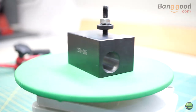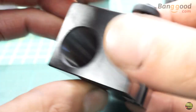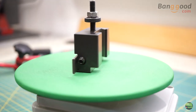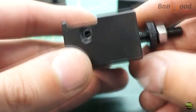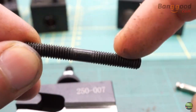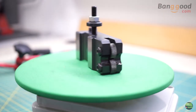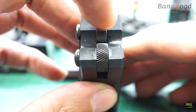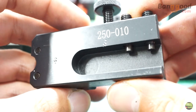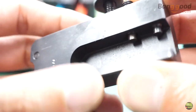The 250-005 holder is another solid piece of steel with a Morse taper, for attaching a drill chuck or any other tool with an MK2 taper. The 250-007 is a cutting or parting holder for a half-inch cutting blade. It's really solid and the groove for the blade is slightly tilted so we need a smaller cutting angle on the blade. It has an interesting blocking screw — half of it has right-hand thread and half has left-hand thread, so tightening is faster. The last holder, 250-010, is a knurling tool. Knurling requires big force to get a nice result, but this holder is made really solid. It has two 45-degree wheels for knurling, and they also added a groove on the other side for a boring tool. It's the only holder where you can see traces of milling — it wasn't completely ground.